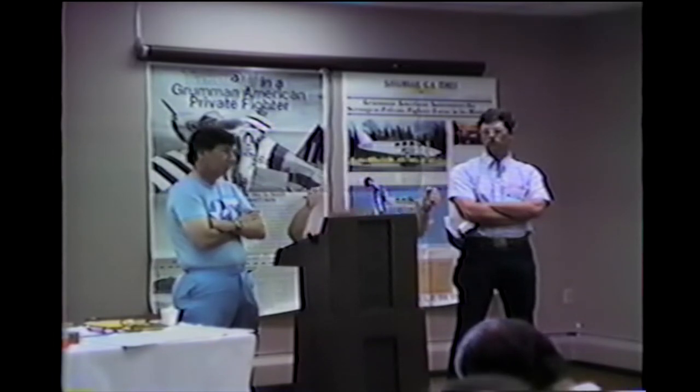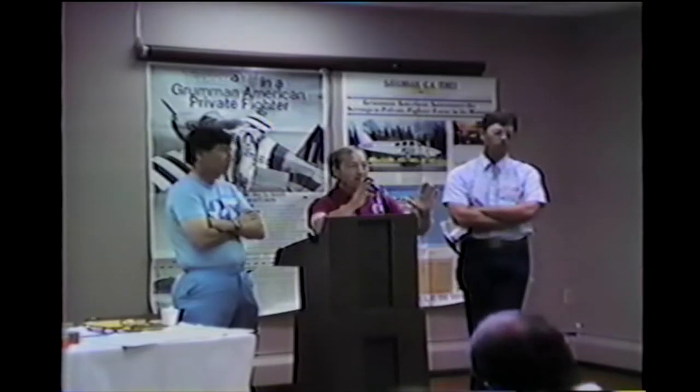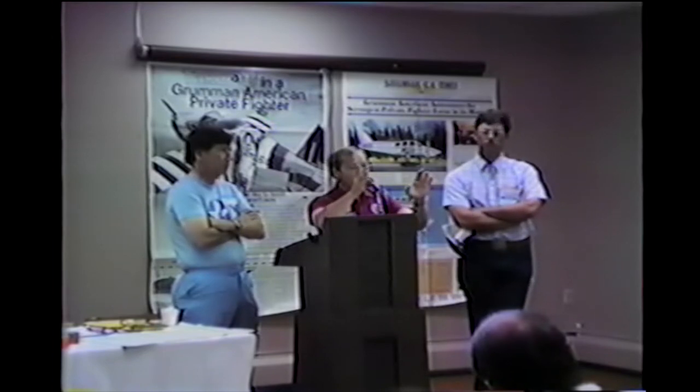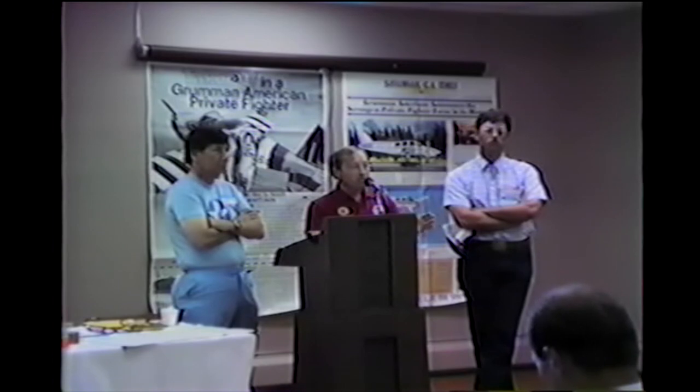One guy holds it in place firmly. Your alternator belt's going to kick the thing out. You're going to have to really push that thing in to make sure it's seated good. This guy kneels down like that while somebody else puts the prop on and tightens it down. Okay? If you try to put it on by yourself, you think you got it in right, that thing will slip down in between the leading edge of the drive bushing and the spacer, and you tighten it down, it's just like a punch press.